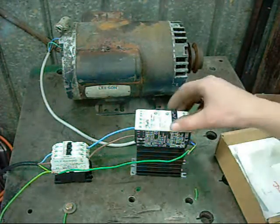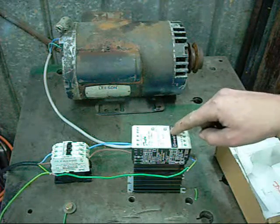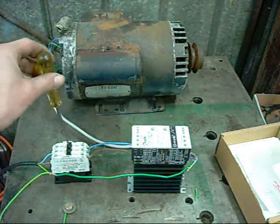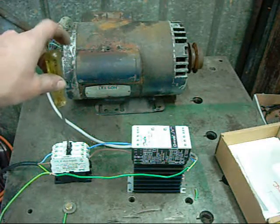What are we set on? That's minimum ramp up time and minimum initial torque, so it's not quite delivering as many amps but it's still not restricting the volts. This is minimum ramp up time but maximum torque — that's sort of what you want for an air compressor or something with a good starting load.